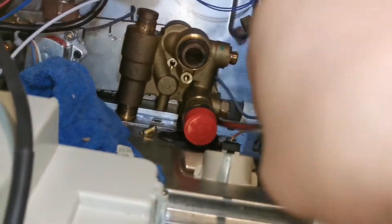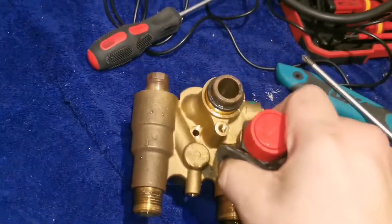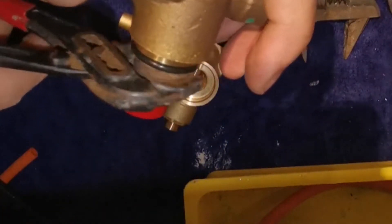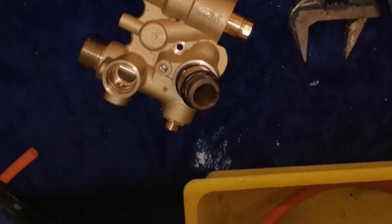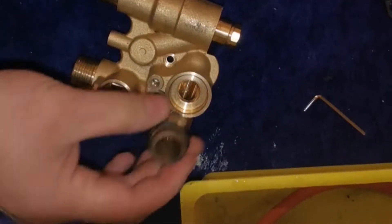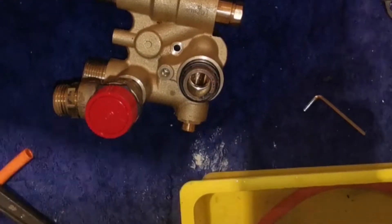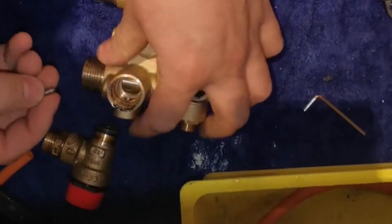As with all Baxis, when you get new parts you want to keep all the old parts just in case, because you never know what a Baxi will give you — sometimes they give you just the bare minimum. As you can see here I've got the new part, so I'm taking off old bits that I need to reuse in the new parts, so make sure you keep everything and don't throw it away. I've serviced the PRV, opened it up, washed out the seating, and I know that PRV is all right — it's not going to be an issue.